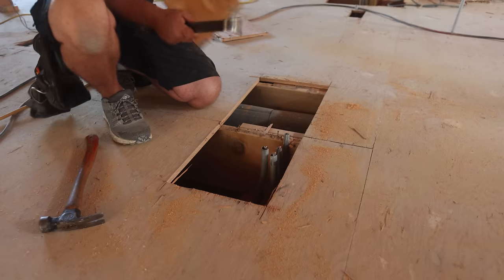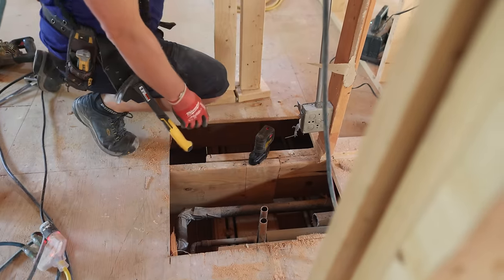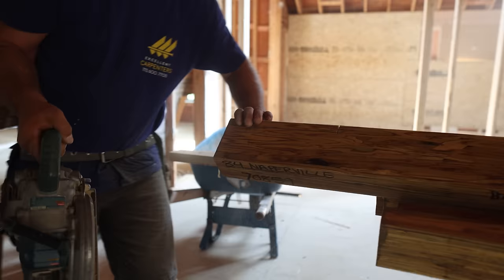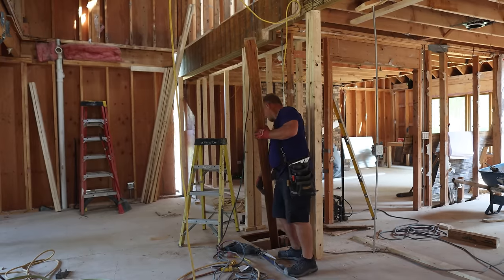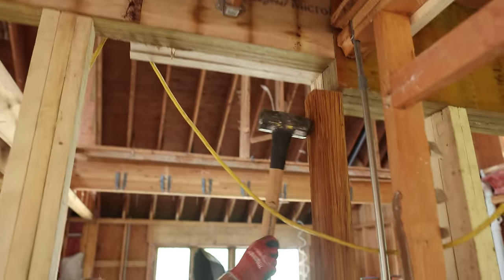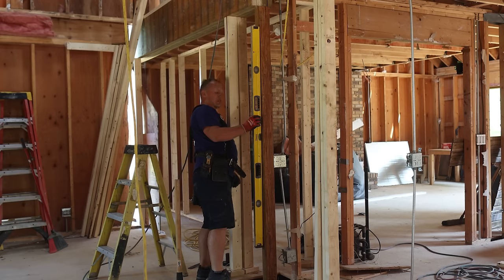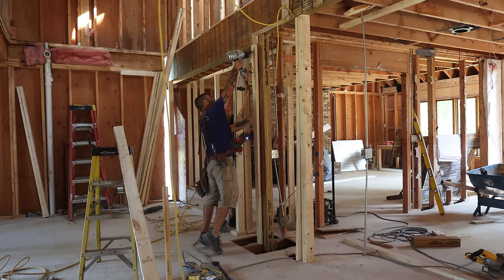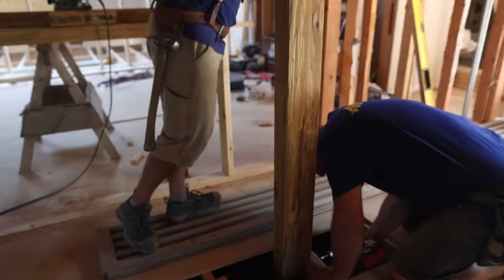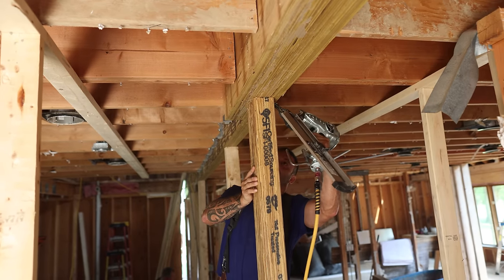To get to the steel beam from above we needed to cut a hole in our subfloor big enough to work around, and once we figured out the exact location we could start prepping the PSL posts for installation. The reason I went with a PSL post versus standard lumber is because it is denser, stronger, and carries a much higher load. It has consistent properties and fire resistance superior to regular raw wood, and it can support longer spans giving you more design options with an open floor plan. This was a big talking point with our architect — with standard lumber we would have needed four middle support locations, but with a PSL we were able to get rid of one post at the front door, opening up the entire entryway with only three columns.